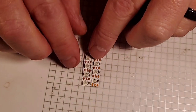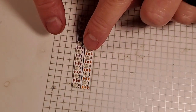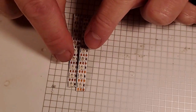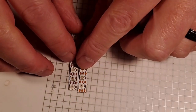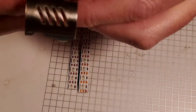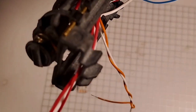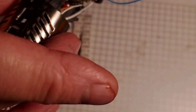Okay, I have scrapped the idea for 2020 Neopixels in here because what I was trying to do was too complicated, and the 2020s just weren't working out, bending around the curves. They were shorting out. So I'm going to use 35-35 strips, and I'm going to use 2 of them. We're still going to have counter-rotating turbines, which will be pretty cool, and I have done that before in the nylon hilt, but it's just going to be 2 of them, and you'll see that in behind these windows when we're done with the build. So they're going to reside in this part of the chassis here, and they'll shine through on these windows when that part of the chassis is installed.